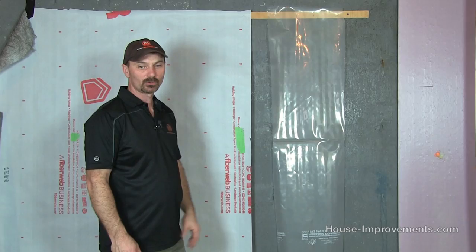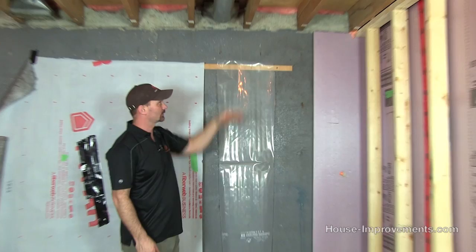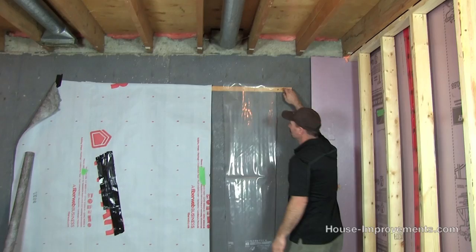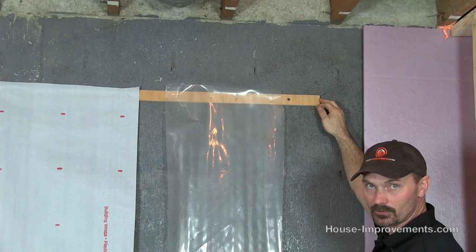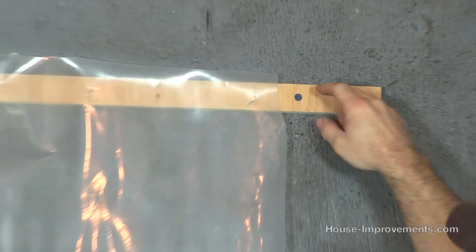The other two methods are dealt with a little bit differently. With the spray foam it goes right from floor to underside of joists, but these ones don't. For these, first we want to attach some type of a wood strip to the concrete wall that's 12 inches above the exterior grade. So if your dirt outside is somewhere down here, this needs to be about 6 to 12 inches above. Attach it to the wall — it doesn't take very much to do that, but you will need a hammer drill. I've just used a screw-in type anchor. Attach that to the wall and it's simply there to hang these two products from.